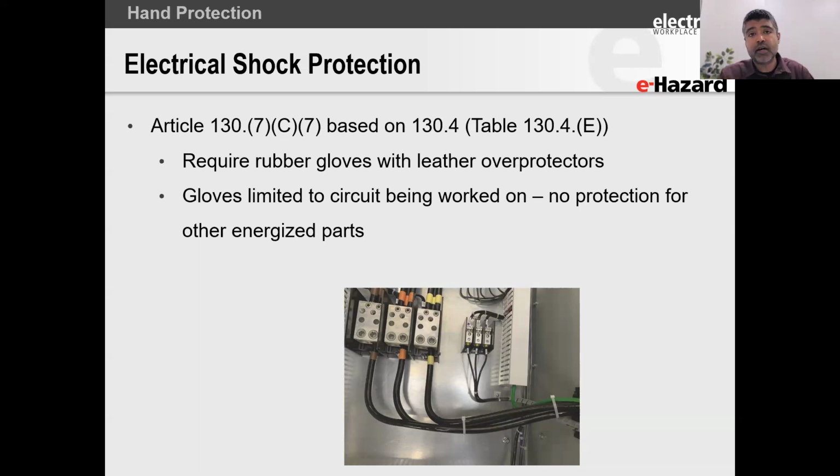And that's why I've got this picture here, because this arrangement is something very typical that you would see in industrial control panels. Sometimes people don't get into these control panels, but another easy way for engineers to design systems and for electricians to build systems is something called a wire trough. A wire trough, or wire channel, is typically where you could come in with very large cables and then split those cables out to feed other smaller loads.